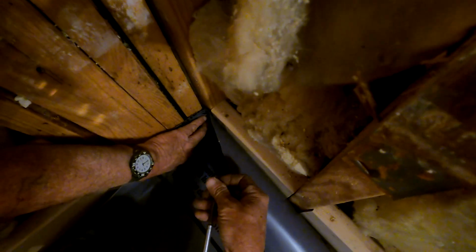And again, I'm not proposing that you have to do a liner. If you can get a tile ready base and go that way without a liner and without mortar, then by all means. They are very pricey, and they're going to go by your measurement when they actually cut one. KBRS is another company, and again, they make custom pans, tileable pans, but they are very pricey, and they're usually about 2 weeks out on getting you your order. And so contractors don't generally have 2 weeks. You might have 2 weeks to spare, but that is an alternative to doing all of this mess, because I really do get tired of doing this.